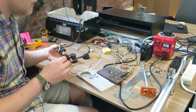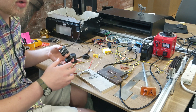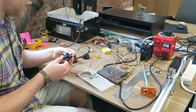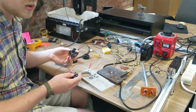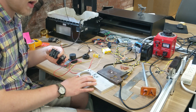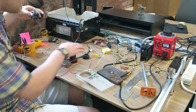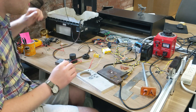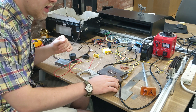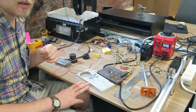I think that's because, although each spark has more energy, it takes longer to charge the capacitor up again and you don't get as high a spark rate. I was using this 120 microfarad capacitor before, and it works, but it leaves a very rough texture — like a very aggressive bead blast — and it gets very hot. With this one microfarad capacitor, it runs a lot more smoothly. The actual arcing is a lot more stable, and the surface finish it leaves is really nice — like a very fine bead blast or almost like a sanded texture.